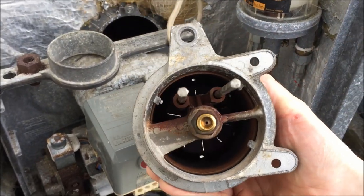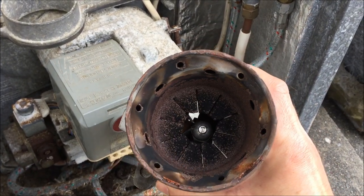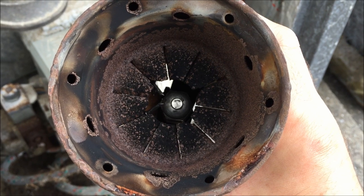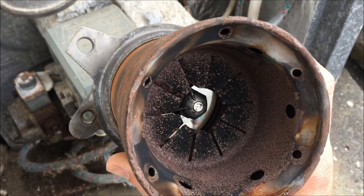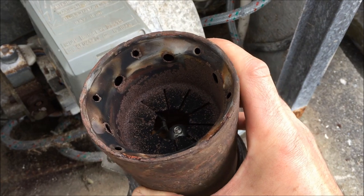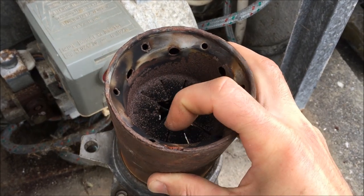The air gets blown from here, there are two electrodes on top — those two bars sticking out — the nozzle attachment on the back, and the little brass thing in the middle. That little shiny silver thing in the centre is the jet — you can just see that tiny pin hole in the middle of it. Kerosene, or heating oil — I think it's kerosene in this one — shoots out of that little tiny hole. Those two spikes in front of it create an electrical spark and that makes the oil burn. It shoots out a jet of oil, sparks, sets it on fire. The air fan and this little louvered blade duct cause the air to swirl, making the flame shoot outwards.